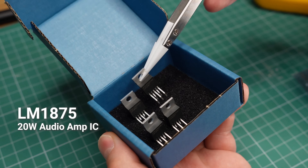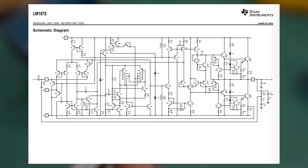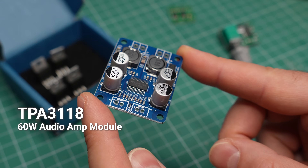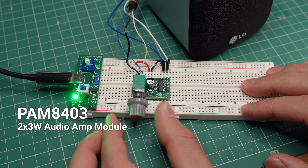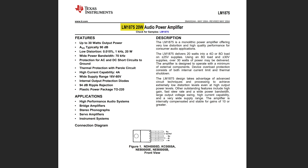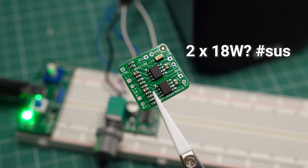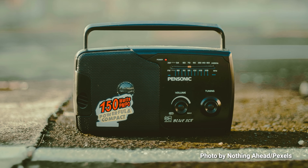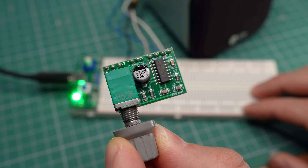The easiest way to make an audio amplifier is to use an integrated circuit. The chip contains most of the amplifier circuitry — you just add whatever additional components are necessary following the datasheet and you've got a working audio amp. And if you look at the specs for any power amplifier chip, you will find a power rating. The higher the number, the louder the party. However, this power rating can be misleading. It is not as bad as that PMPO nonsense, but it's still a power figure you may never achieve.